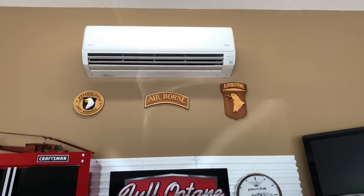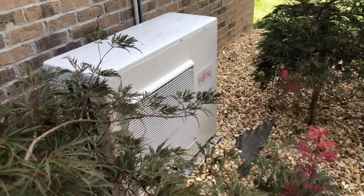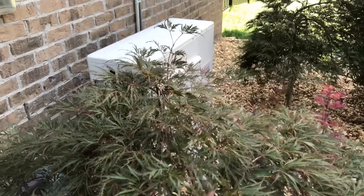So what's the verdict? This is a two-ton heat pump inverter-style Fujitsu mini split. The garage is about 700 square feet, 91 degrees outside, and three or four walls are uninsulated — the ceiling is insulated. We ran the garage up to 98 degrees, and the system brought it down to 76 degrees in two hours, and it easily maintains temperature even at 100 degrees outside. For heating and cooling a single continuous garage space, I say absolutely nothing does better for dehumidifying, temperature control, and efficiency. There's no duct loss — it comes right out of the unit. It is the optimum selection.